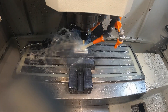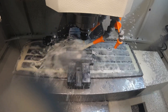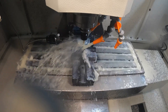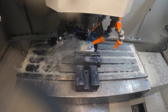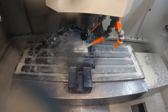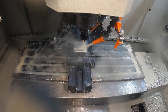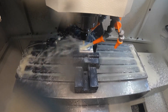Moving into the 3D spiral toolpath. I'm using a 3/8-inch 3-flute ball mill for this operation, running at about 10,000 RPM with a 0.010-inch step-over. This is just going to do the finished surface work on the dome. I was going to try to skip ahead and speed it up, but it doesn't take that long so we'll just let the thing play out.